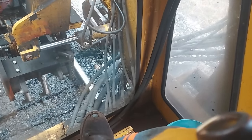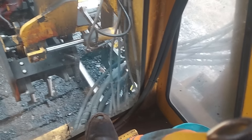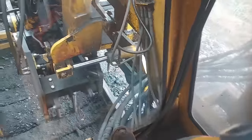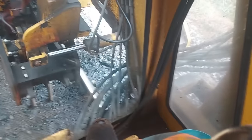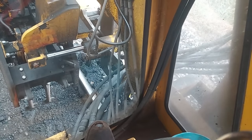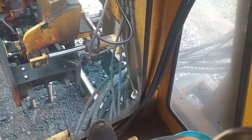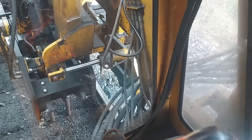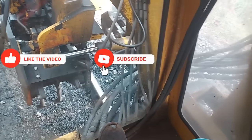Had a video on crib sweeping before, up there above Bridge 4. And we're going to do the high side too. This is a temporary situation. Temporary fix here. We got a really low joint here on the outside. And try to get some decent rock in here to try and hold this track surface till we can get up here and get this cribbed out.